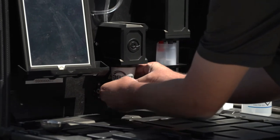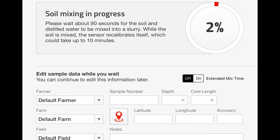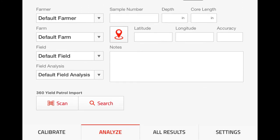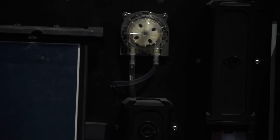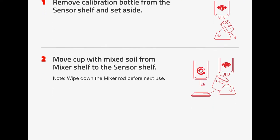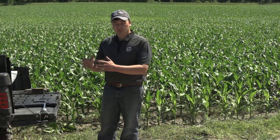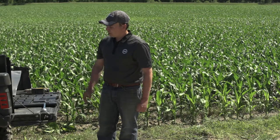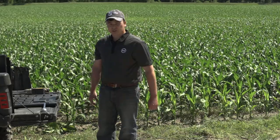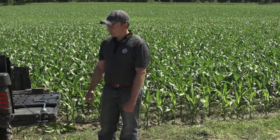We'll place it in our mix station. While we're mixing our sample, the SoilScan is set up to calibrate itself each time — between each sample, we have a standard solution in our sensor station that's allowing the SoilScan to reset itself from the previous sample. It's recalibrating as we speak, and at the same time it's mixing our sample to create a soil slurry that will allow us to measure how much nitrate is in the sample from the field.